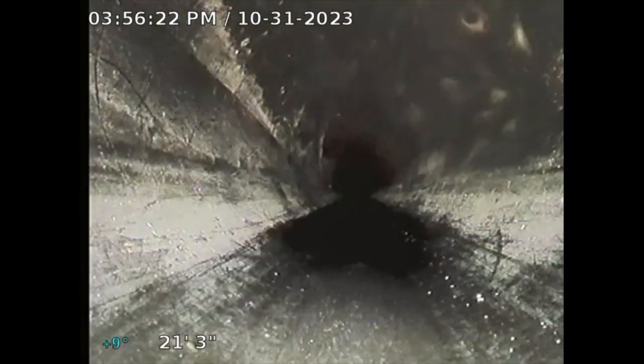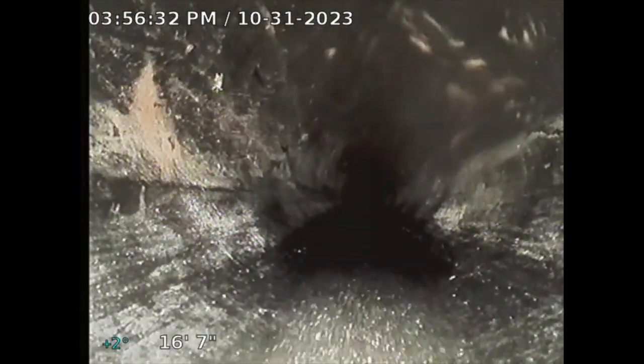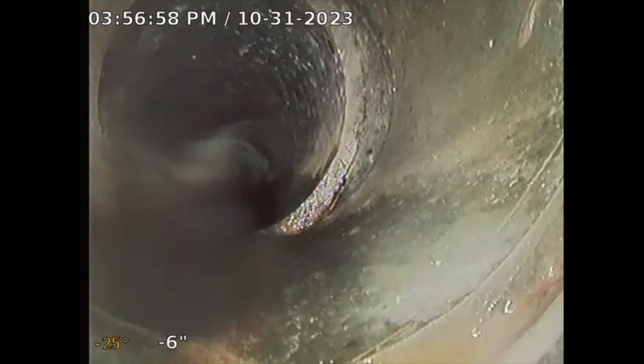You have a liner. This is ABS. And the rear of the pipe, now I'm going to just try to take it as close as I can here, and then we'll see if I see the flush from the rear unit. Just because it's concerning me that +4, and then so this is pretty much flat. See that? Plus floor. There's not much of a slope here. There is a slight slope, but nothing. I recommend having a better slope. But since it's an ADU in the back, they had to do this. So let's see. 5 feet. All right, so now I'll leave my camera in here and I'll flush that toilet.